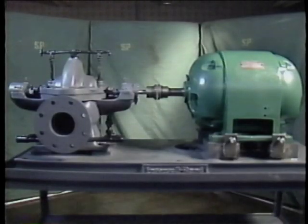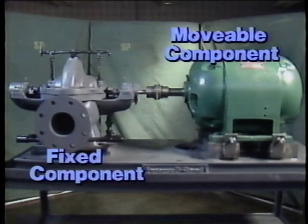One reference point you'll need to establish is your orientation in relation to the equipment. Although you're likely to find many different combinations of drivers and driven equipment, a common situation involves a motor and a pump, so we'll use them as an example. The first two terms we need to define are the movable component and the fixed component. The movable component is defined as the component that will be moved in order to align the shafts — generally the one that is easier to move. Because pumps are connected to piping that makes them difficult to move, motors are usually chosen as the movable component. The fixed component is the component that is not moved — it remains stationary, and its shaft becomes the reference that is aligned to. Since pumps are generally more difficult to move, they're usually chosen as the fixed component.